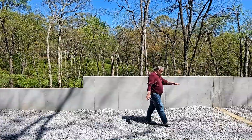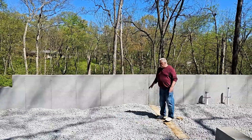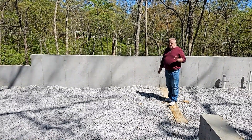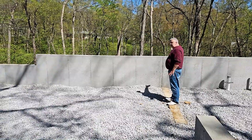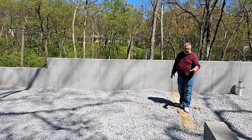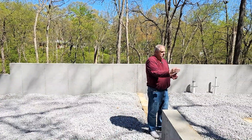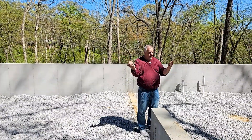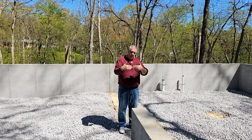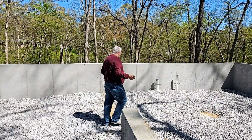Notice we have a few tie-ins — we have a lower shear wall here. This is a very long wall, on the order of about 54 to 56 feet, so we don't want it to bow out or bend. We put in a buttress, and on this side, because it's only a four-foot wall, the shear wall goes up much higher, buttressing this wall and essentially cutting it in half. Think of that wall as nothing more than a beam that wants to bend inward.